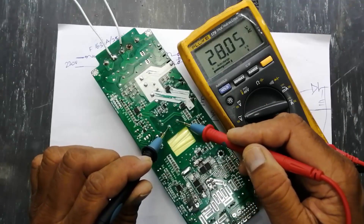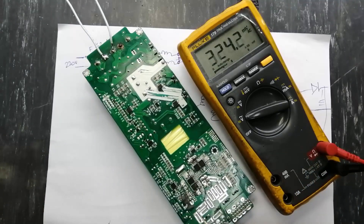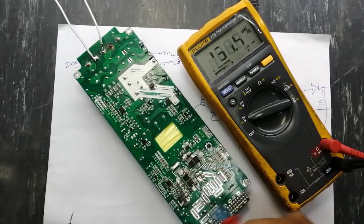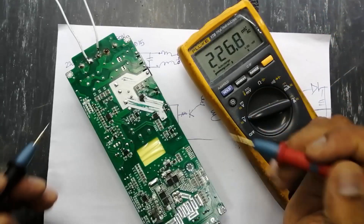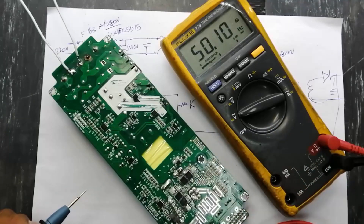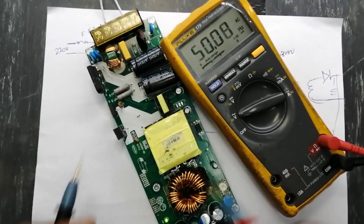The switching voltage is 28 volt AC. This is a 60 ampere supply — very nice design. Today we made a review of this power supply. In the next video I will share complete design details. The protection diodes, one and two for both MOSFETs, are 18 ampere 500 volt MOSFETs — SLF18N50C. Here is the optocoupler.